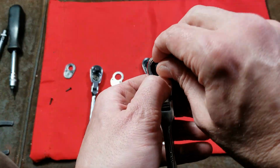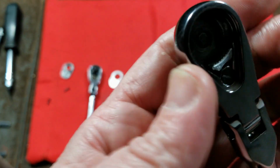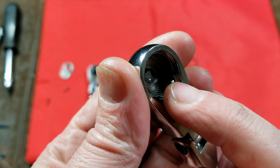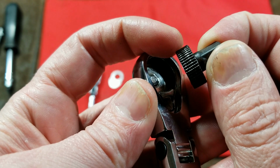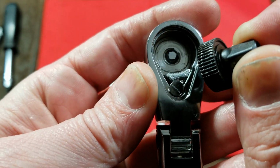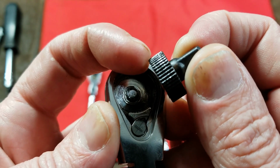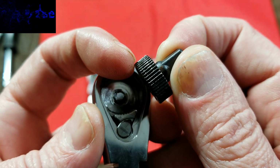And now with the walking pawl design, if we pull this out and don't lose the pawls, we can see in there that there's actually two separate ratchet pawls. They're two separate little units in there. And so when you have an anvil that's rocking back and forth, you only have one pawl. They do both engage if you put a lot of torque on it. That's what I've read online. But under more normal situations, when this is rocking up, it's just engaging on the very corner of this, or just on one little edge.